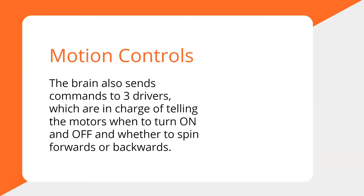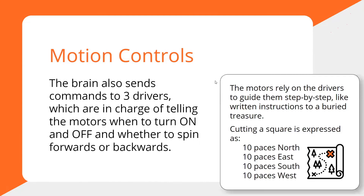Motion controls are all the parts that move in the laser. The controller sends signals to drivers — those little boxes that look like a time bomb — and each driver talks to a motor. One motor moves the laser head left to right, one moves the gantry arm forward and backward, and one raises and lowers the table — your x, y, and z. It's like an old treasure map: take 10 paces north, 10 paces east. If your laser cuts a square, it literally moves 10 paces north, 10 east, 10 south, 10 west.